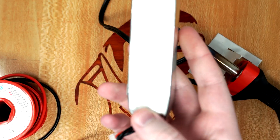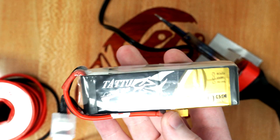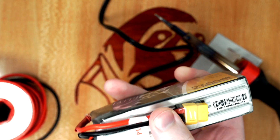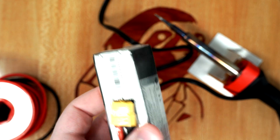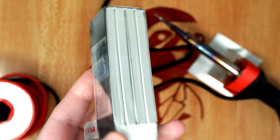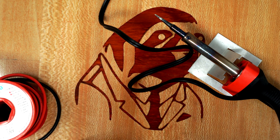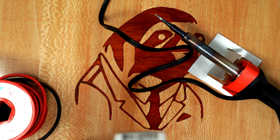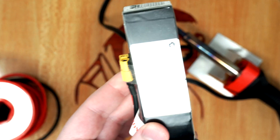Battery. This is a 4 cell LiPo battery — 2300mAh and 45C, which should be plenty. This is a big battery. I tried to get as big a battery as I could fit in this case, but this battery size might end up causing me problems later. The next step is to do a mock-up of all these parts before you actually start soldering, so we'll see what that looks like.